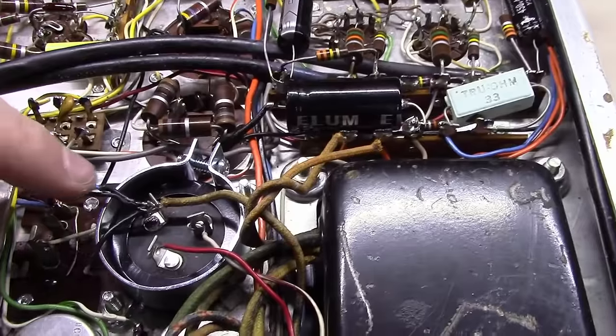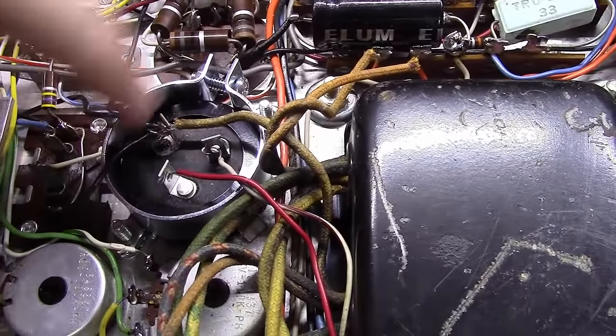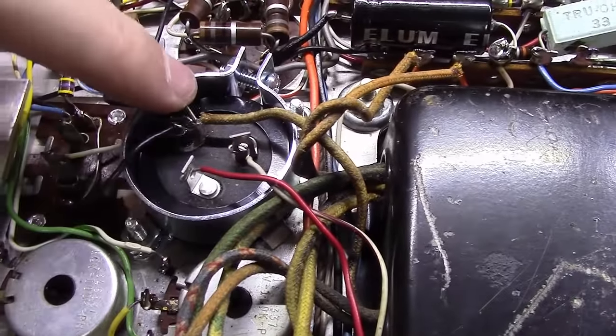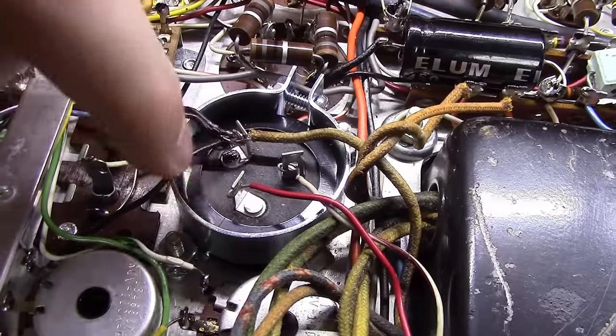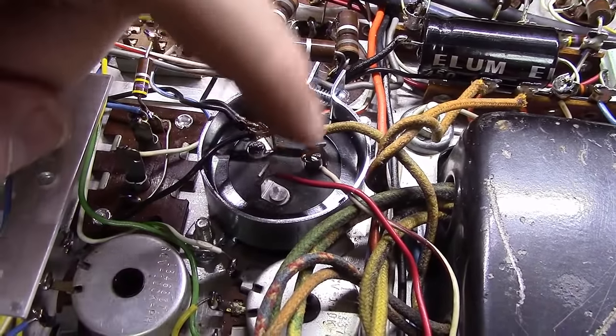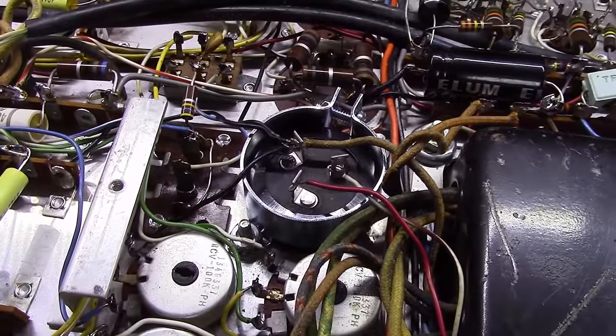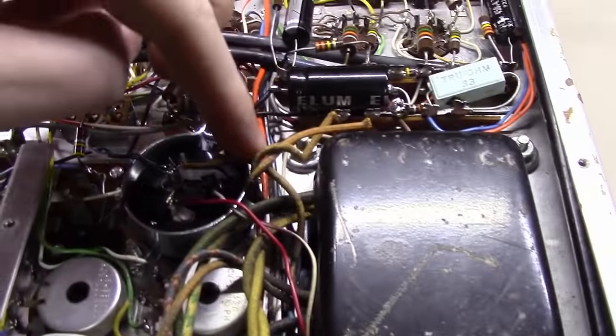And as you can see, I've got the 4 wires run here, all inside the hole in the black lead here, the negative, and I've got all the wires wrapped around really well. Similarly here, I ran the wires in and wrapped them around so they're good and tight. They're being held in here mechanically and not just by the solder. And now we're going to solder these things up. Okay, we're all soldered in.